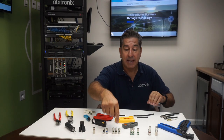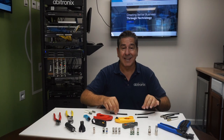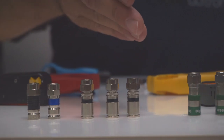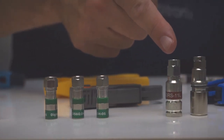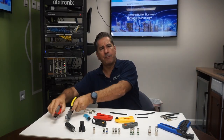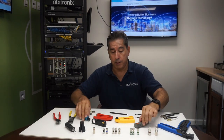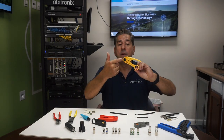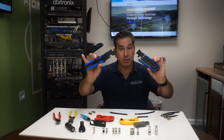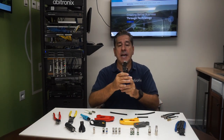The tools you're going to need to compress and install a compression connector over a coaxial cable — in this case I'm using RG6, but there's a variety of coaxes out there: RG59, RG6 standard dual shield, quad shield, and RG11. Tools you're going to need: a good cable cutter or wire cutter, cable prep tools ranging from simple cheap ones to nicer fancier ones, and finally the compression tool — you have the clamshell style and the ratchet style.